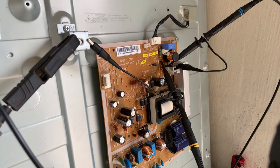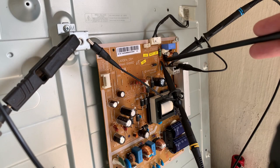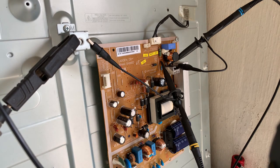Right, I've replaced this little resistor down there. And as you would have seen earlier, we calculated that we need a 25 ohm resistor, and I've made the mistake of not thinking this through properly. I calculated that resistor, if you remember, together using a DC current flow for an LED, and we fell straight into that trap that Australian fellow will call the trap for young players.